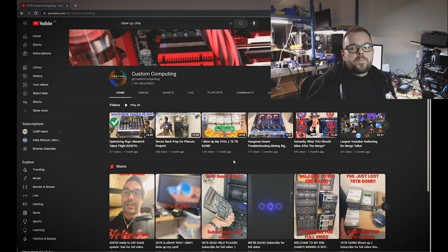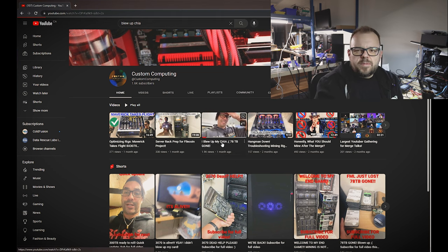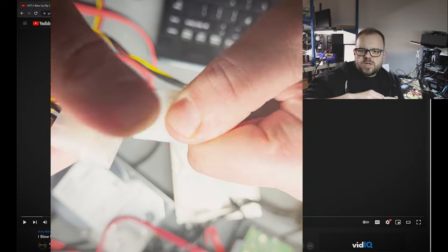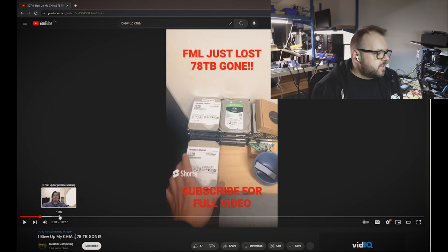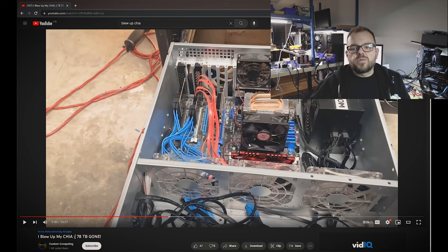After some logistic issues we met up on Sunday, a few days ago - today's Tuesday. I picked up the drives from him and fixed them. I filmed everything and I'm also going to give him the footage so he can make his own video. I think he plugged in the Molex cable the wrong way - that's a very common problem. If it's a Molex SATA and you plug it in the wrong way it will just blow up all the drives on it. I've done it myself - it's easy to force the connector in. These are all the drives he blew up, that's his server. Check out his video linked in the description. Anyway, let's jump into this repair.